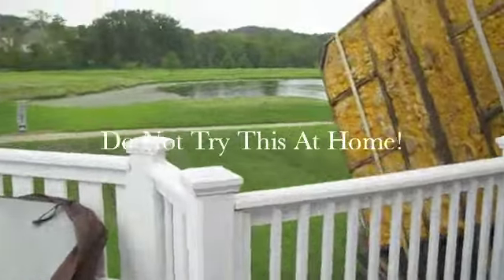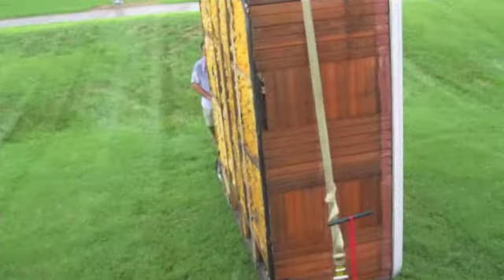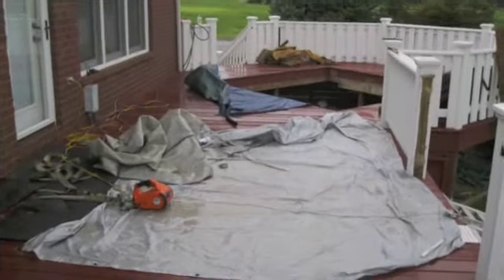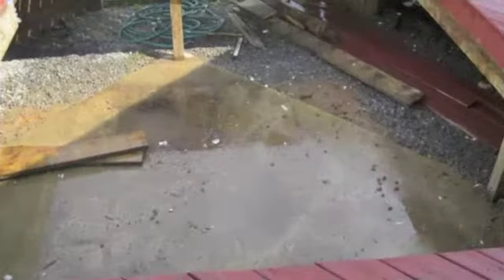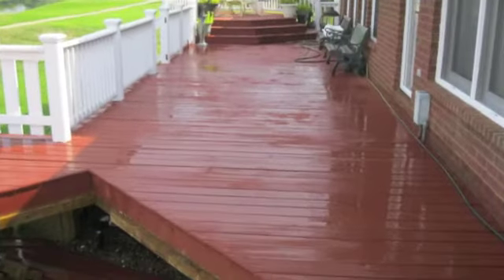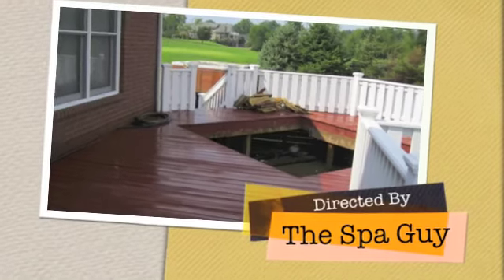We've got the winch holding it and it's going down. We've got Rika who says he's not going to be in the movie — too bad, he's in the movie. This hot tub was extra hard to get out of the hole. Normally we do yellow straps and pull the straps tight, but this hole was about two feet wider than the tub on both sides, so we decided to airbag it and flip it with the bag — basically float it and then flip it up. That's how we got it out of there.